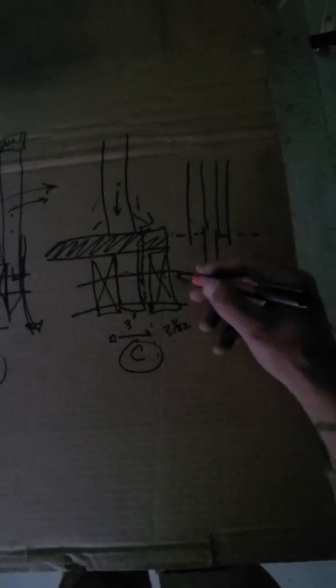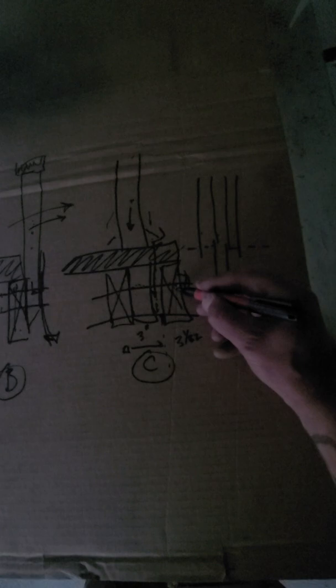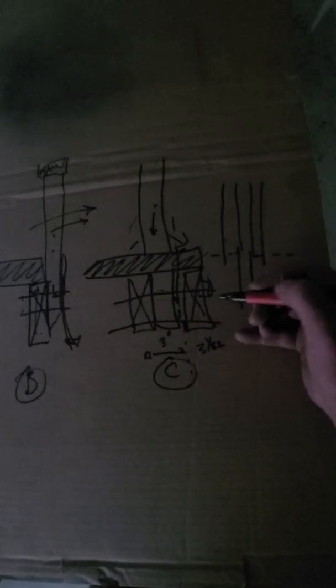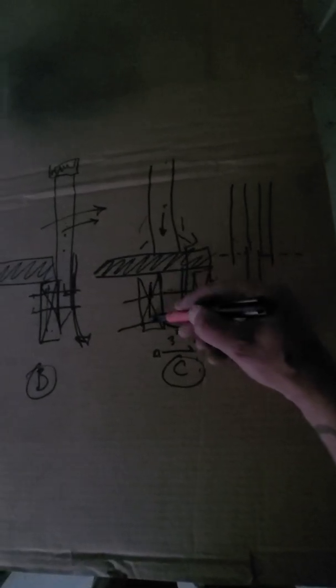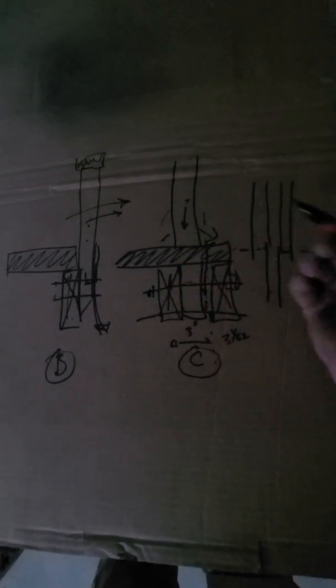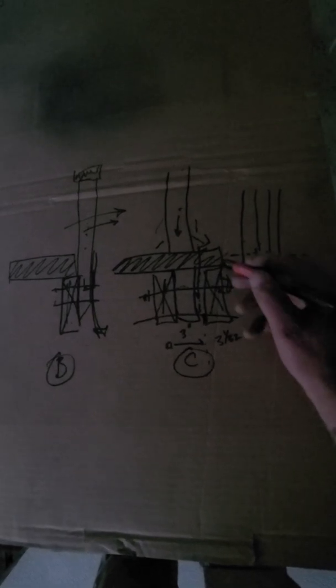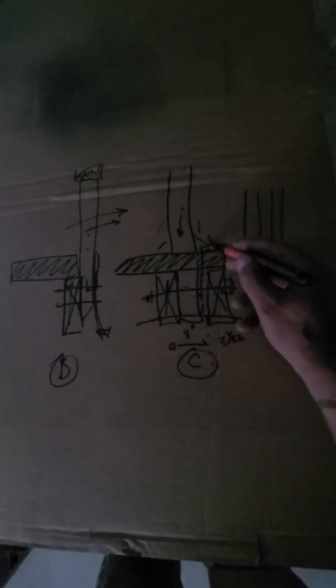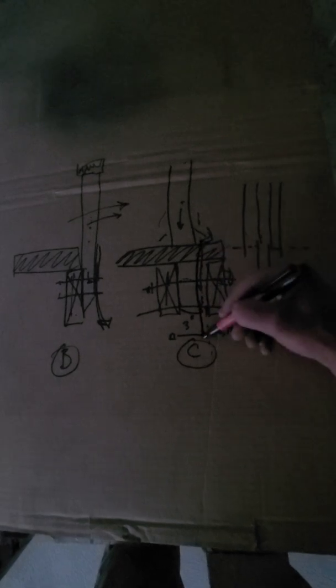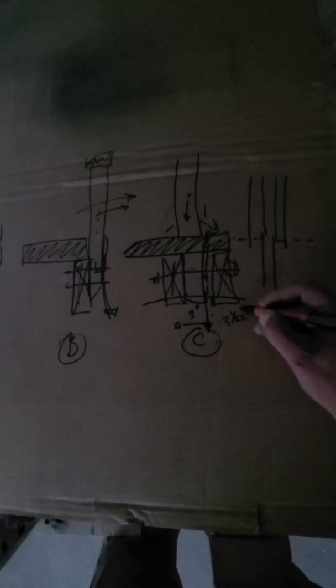When we're doing option C, we've got a carriage bolt that cannot spin out because it's locked into the rim joist. It's also anchored into the deck. Put a lock washer, a washer, and a nut on the back. That's not going to go anywhere. And any water that you get underneath that skirt is just going to drain out anyways, because you're intentionally leaving this 1/32 of a gap anyways.